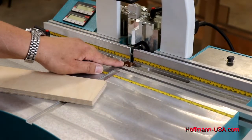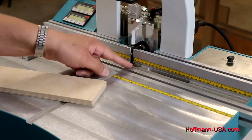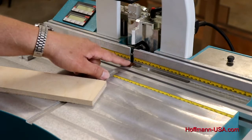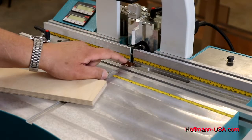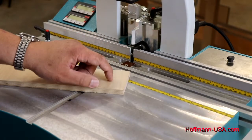The chip breaker will only do its job if it has a clean outline cut of the router bit. If this is torn out or chipped on the top, then you may as well not have a chip breaker in there because it can't do its job. This is the reason why the first cut needs to be made from the top down, and we need to place some sacrificial material on top to basically act as a chip breaker for the chip breaker for that first cut.